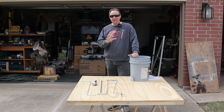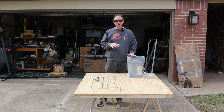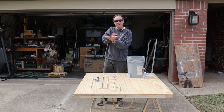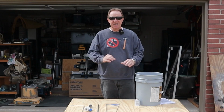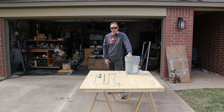And I put a lot of that to the water quality that I have here. And what I wasn't able to show you, which I wish I could have, is that bottom element was sitting right in that sediment we flushed out of there. That sediment was all the way up to that bottom element, which is about 4 inches. So that's a lot of sediment in just 5 years. I mean, some of you probably get 10 plus years and don't have that much.